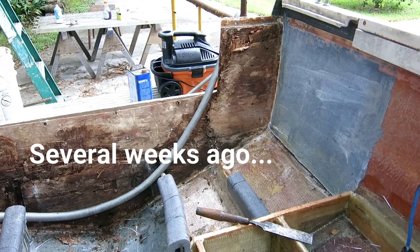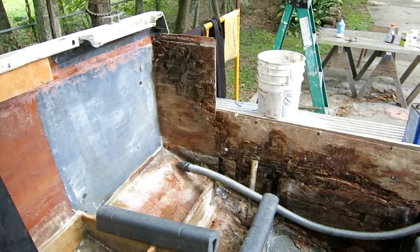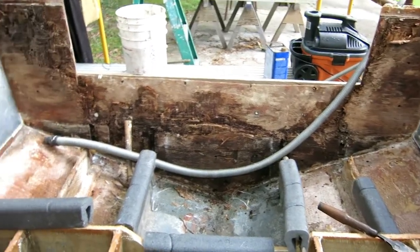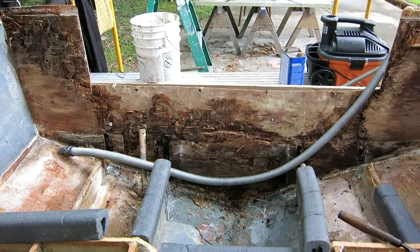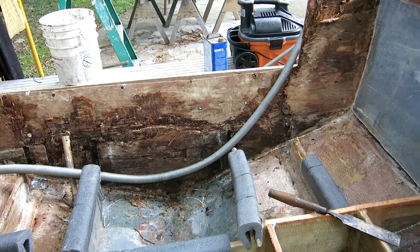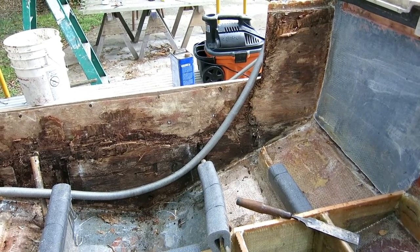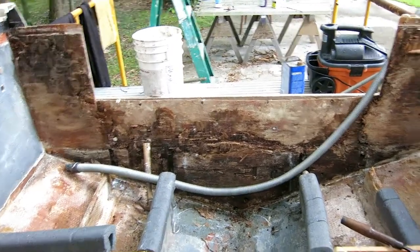I'm ready, or at any time I could put the Coosa board on the transom. But I don't want to, because I'll have to climb over it every time I get in and out of the boat. And I have an awful lot of stuff to do that's totally unrelated to the transom, and I'd like to do it first. However, I want to use the Coosa board to build the door for the console. And it's coming out of the same piece I'm cutting the transom out of, so I think I will cut the Coosa board to fit the transom, put it away, and use the scraps to go ahead and build the door